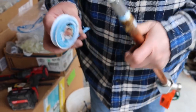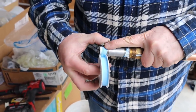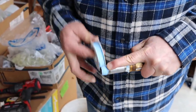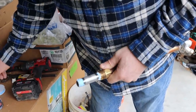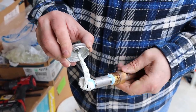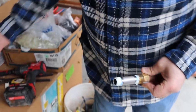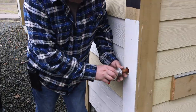You don't have to go this far — you could use just pipe dope or just teflon. You want the teflon to squish that pipe dope. I put too much on there, but I've noticed this takes way longer. I get paid more the longer it takes — no, not seriously. If I do this I never have a leak it seems like, though of course that's not 100% true.